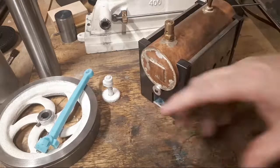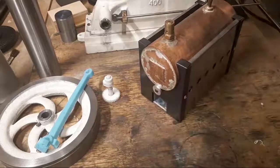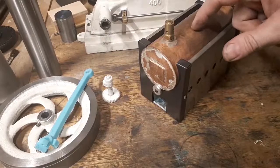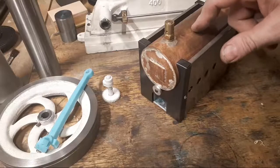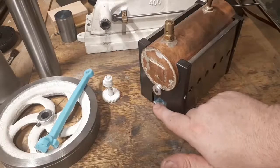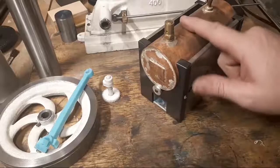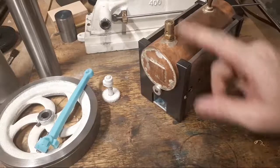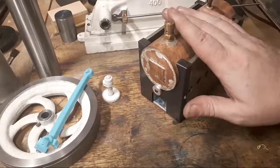But I'm going to need an external tank because of the size of this boiler. The little tank that I did make is not big enough to run this until it gets empty. So this one's actually had a fire in it, and it's actually made steam, and we've actually run an engine with it. But the burner that I had just doesn't run long enough to really boil this from cold, which it really should, let alone give it a decent run. So that's where we're at with them.